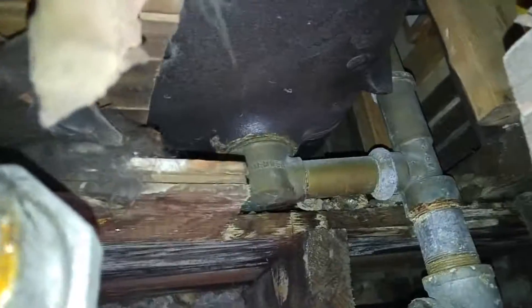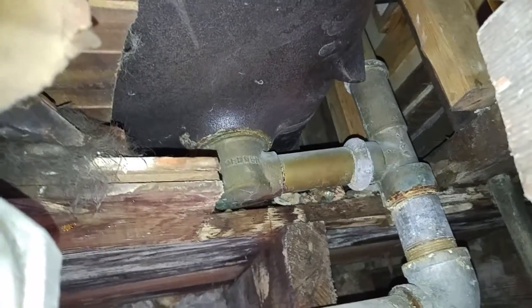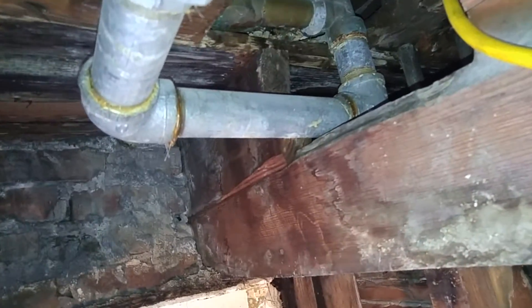What we're gonna do is cut this stuff out. Up here, we're most likely gonna carefully cut out that elbow because that's cast iron, and go directly to that pipe there. The best way — like in math and geometry, that's why a straight line is important. Look at that bathtub — it's pitched the wrong way.